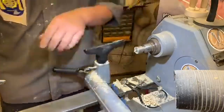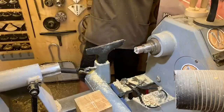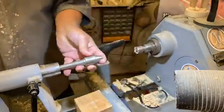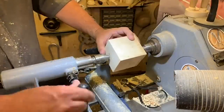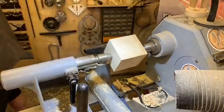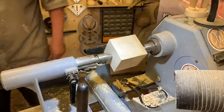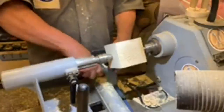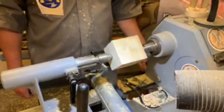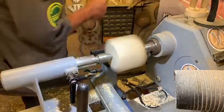I've centered up already. Lathe speed to zero to start, then I'll turn it up to about 1400 to 1600 for this one. I'll start with a roughing gouge. All smokers are nice and plump — we want it nice and fat. I'm going to create a little foot for my C jaws here. We're aiming for 58mm. Now we can put the C jaws back on. All of these things can be prepped in advance — do two or three at a time.